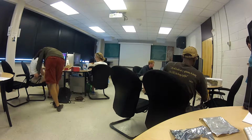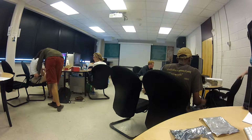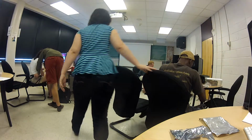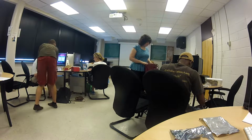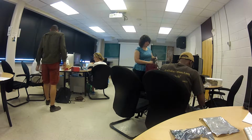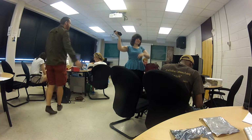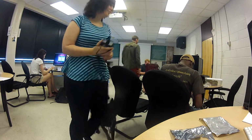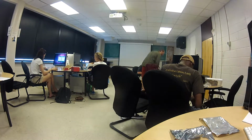You don't need to attach a battery here because this thing is actually big. So what you do instead is find the pin that you want to attach. That's your power stack. The positive end goes into pin 13, and then the negative end goes into ground. You see it says GND? GND is the negative side.